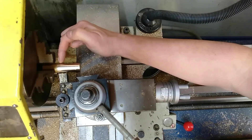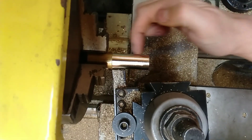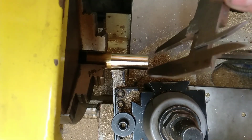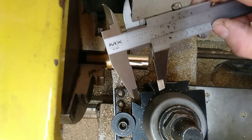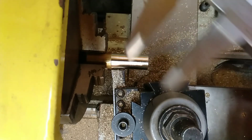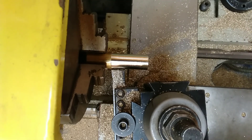You can see that I stopped a little bit of a distance away from the teeth there. You want to get in nice and close to get the most out of the entire section, but you don't want to go all the way and touch the teeth with the cutting tool. I'll measure that with calipers — I've gone down to 19.4 millimetres and I need to get a little bit closer than that. If I set my calipers to 18 millimetres, I can now use them like a snap gauge.